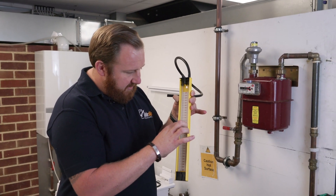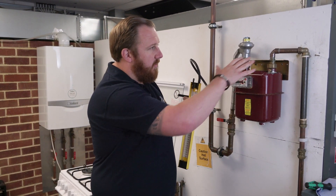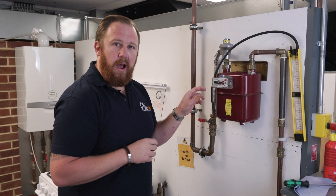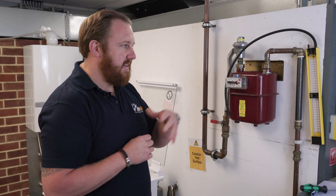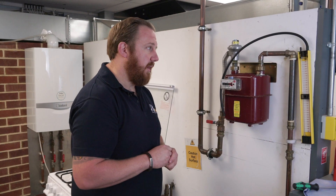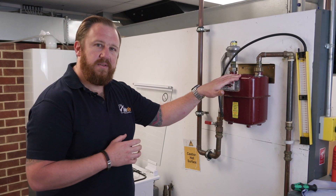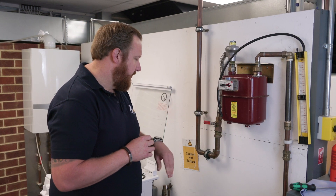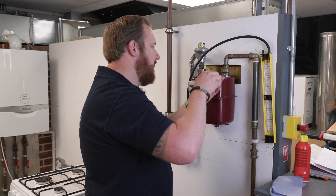We need to make sure we've got water in our gauge, that we can read it nice and clearly, that there is sufficient water, and that we're level on zero on both sides. We've got a screw here which is handy so we can hang our U-gauge up — it's important to keep the gauge secure, not just propped up, and nice and vertical for an accurate reading. Whenever we're putting equipment onto or removing it from a gas system, the gas supply must be switched off. So the ECV is in the off position and we're going to remove the test nipple.